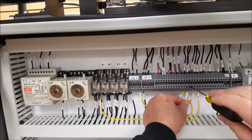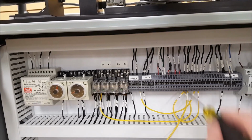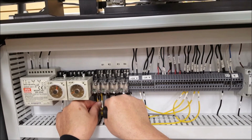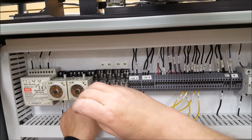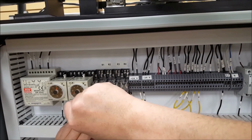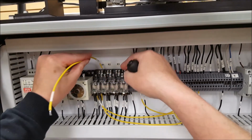The next wire will be our stop button, push button 3, pin 2, and wire 2. And that's going to go right to control relay 1, the plus side. That'll be our actual output. Energizing this coil will be the output. So put that into the plus side terminal down underneath. That's the lower one to the left in the block. Get it in there, snug it up, make sure you're good, and that looks like a pretty good connection.